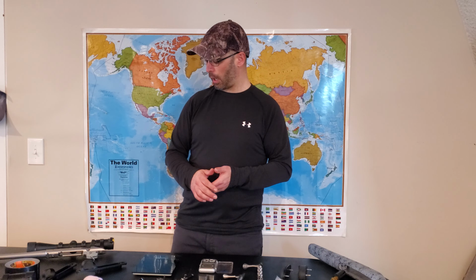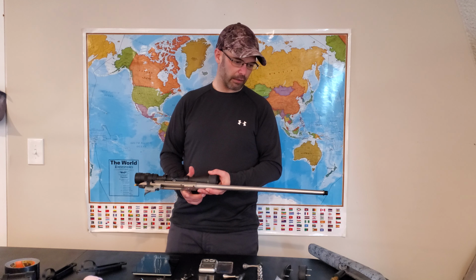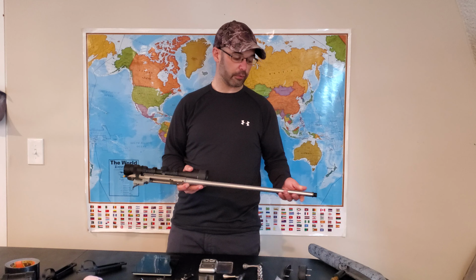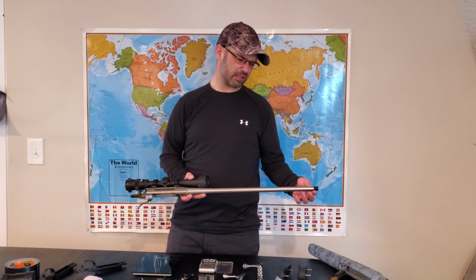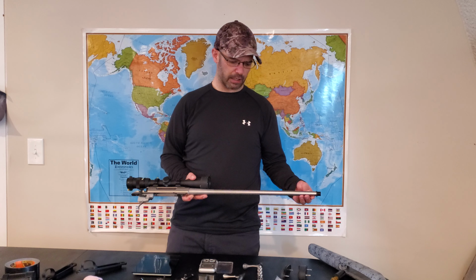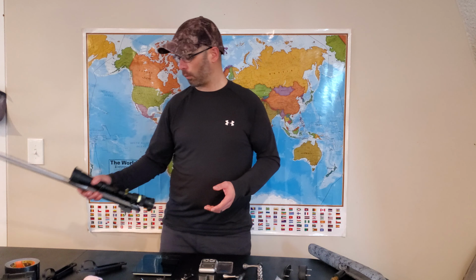And now I have a more compact package. It's lighter weight. It's more compact. When I add a suppressor on the end, it's honestly no longer than it would have been with the factory length barrel to begin with. This one here, cutting off the 4 inches of the 6.5 Creedmoor. Again, I lost roughly 100 feet per second. It was about 2650 with factory 143 ELDX, and it dropped down to about 2550. I was able to gain all of that back just with hand loading. You kind of have to pick your poisons in that regard, but you can typically have your cake and eat it too, and save some of those ounces if you're creative.